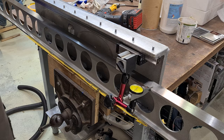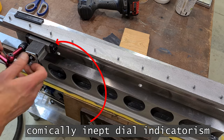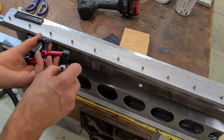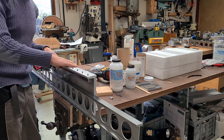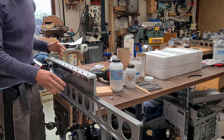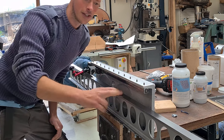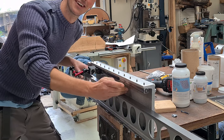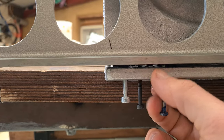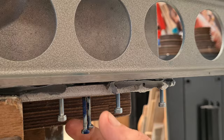Okay I think we can be happy with that. Now we just need to make sure it's right in and out. Here we are at the turning point where we work out if I've ruined the straight edge and made this part very difficult to use, or we've got a perfectly flat edge for our linear guide to mount on. The dial indicator suggests it's very parallel to this surface. Hopefully it's in exactly the right distance. Let's take it off and see what happens. There's a little gap there that I'm going to want to fill in, and the same thing here — there's a little gap where the two set screws are.